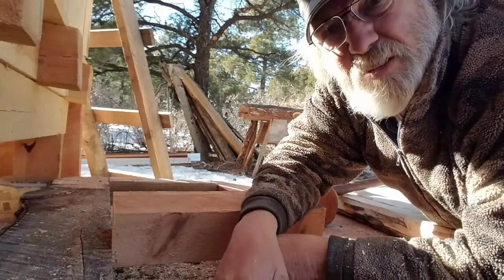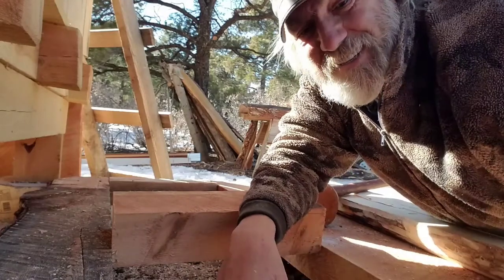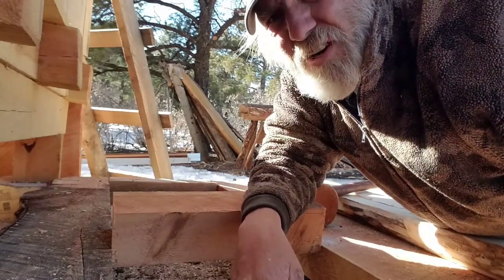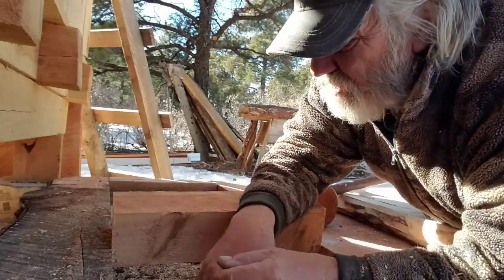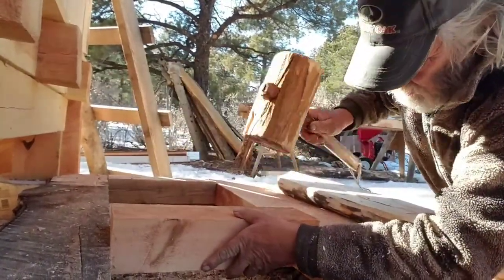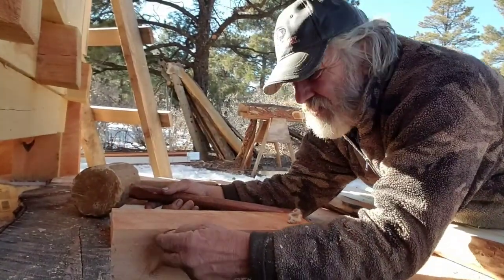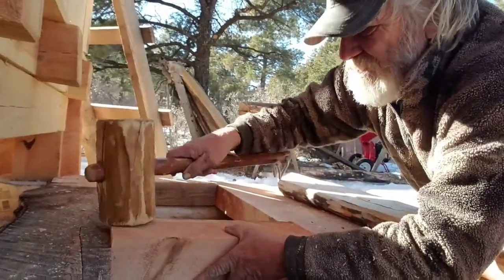Okay, starting early this morning. The roof's still a little frozen, so no drips, because I don't want to scrape up the rubber coating I got up there to get the snow or ice off. But what I did was I put a stone squished underneath there like I talked about, and now I got a cross member I'm putting in here, and I'll run some timber locks in at an angle, wedge this in here so it ties the front and the back.